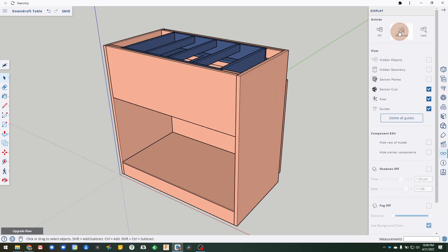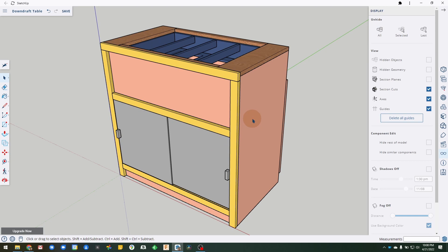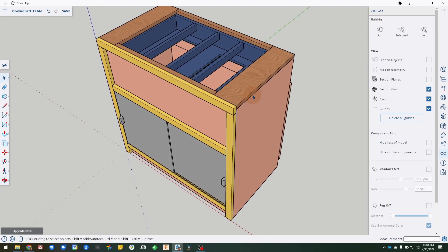I wanted the tops of those downdraft panels when installed to be exactly flush or maybe just slightly below the surface of the miter saw station. So I could build the cabinet to get close but just a little shy of that, knowing that once I put everything in place, while leveling the cabinet, I could also adjust the height and get those panels exactly where I needed them to be. The box is just dropped into the top of the cabinet, and then I tack down these three-quarter-inch pieces of plywood. They hold the box in place and hold the downdraft panels in place from moving front to back or side to side.